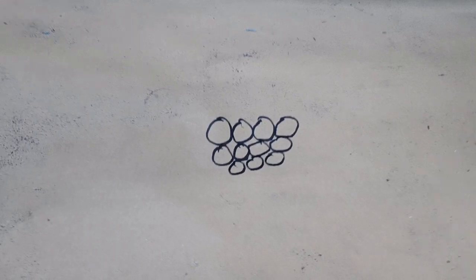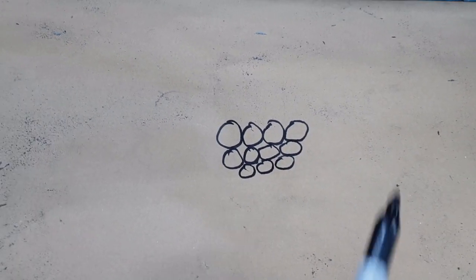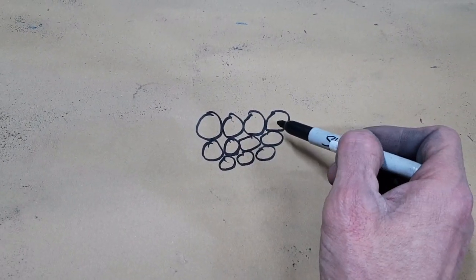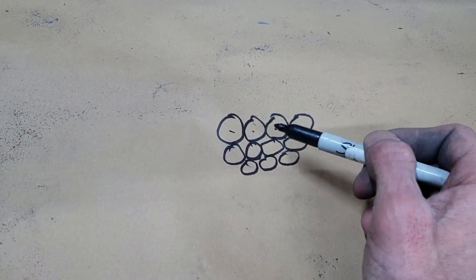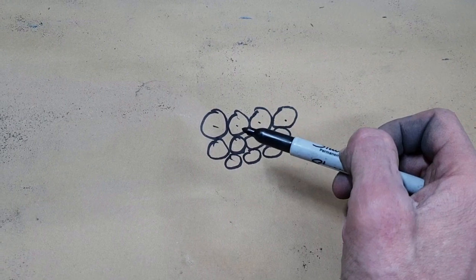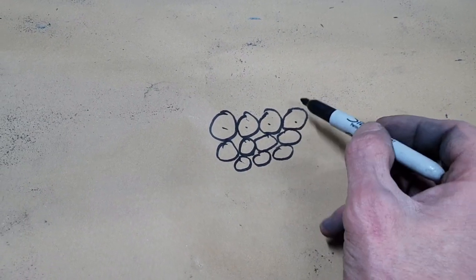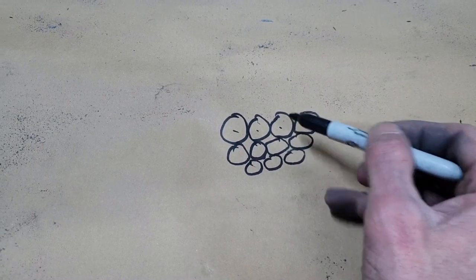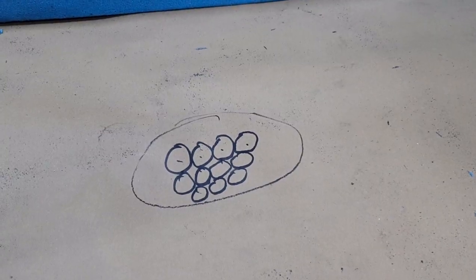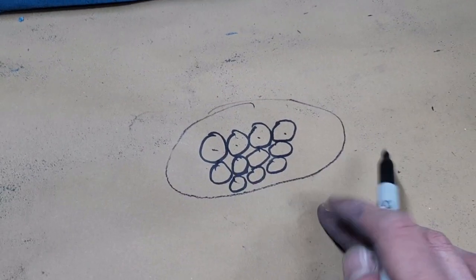So the two chemicals react together. They create an exothermic reaction. The gas inside here, or the air inside here, expands because when something gets warm, the air inside it expands. And the resin itself then skins over, and so that's a closed cell foam.